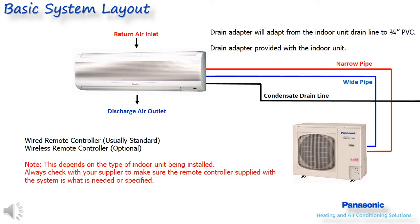Do not form any condensate traps within the drain piping, as they are not necessary. Most units come with a standard wired remote controller, but a wireless remote controller is also available. Don't forget items like a condenser pad, drain line, and line set covers.